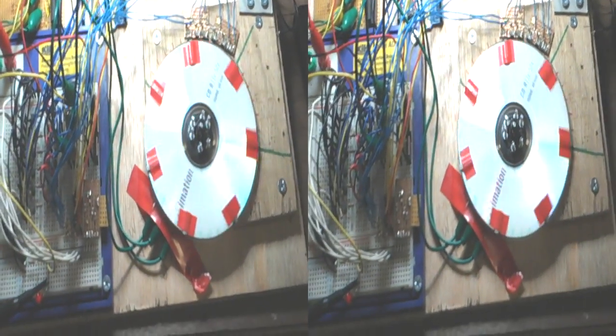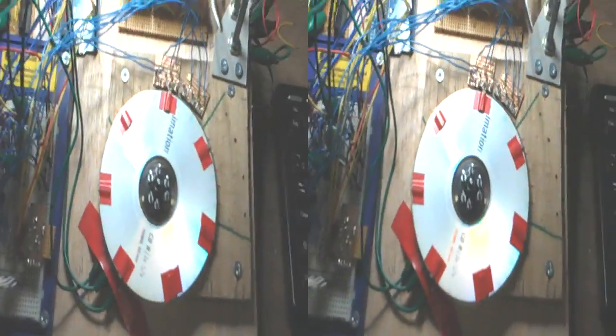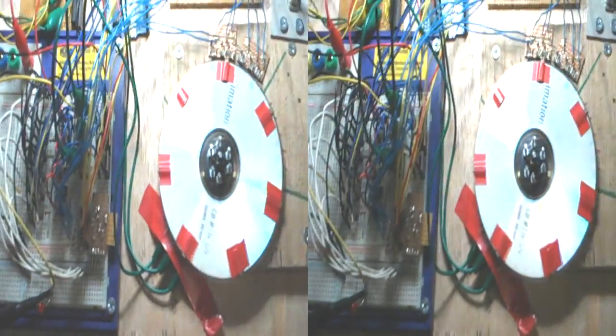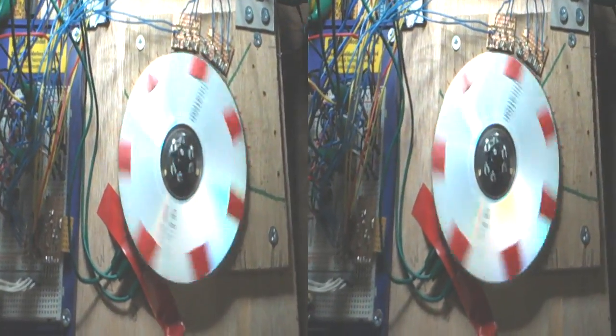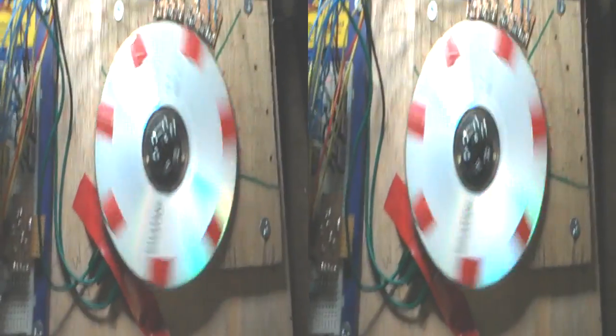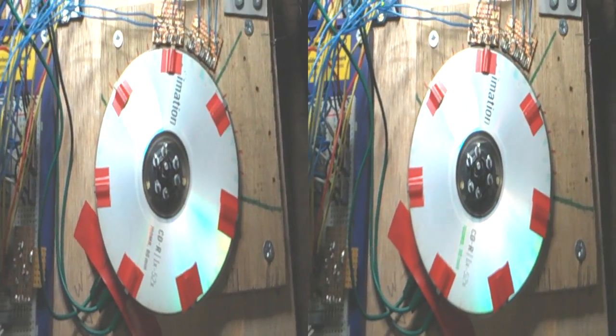So what we're saying there is, this is for a 12-step sequence. We're now running a 12-step sequence at the maximum speed, which we probably wouldn't do, because we'd probably run a 6-step at the very least, maybe even a 3-step. But we can certainly do a 6-step sequence. Now if I reduce it, that's at about 280. That's simulating a 6-step, because I basically reduced the frequency by half, which is what would happen in a 6-step. And it's still kicking a little bit.